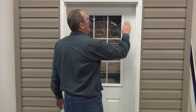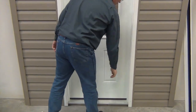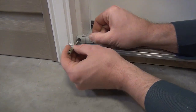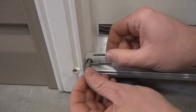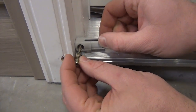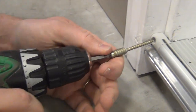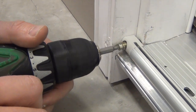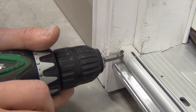As you can see in our installation, we are mounting the screen door to the brick mold around the door frame so that the entranceway door handle and the screen door handle bar do not interfere with each other. Your installation may not have an existing good location to mount the track end cap screws into, and as such may require additional parts provided to give you material to attach the track end cap to.